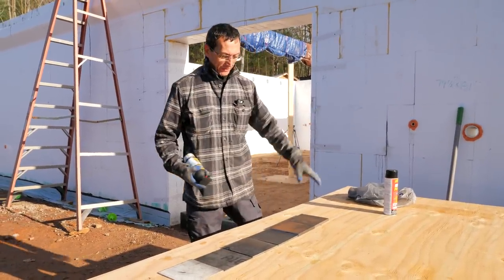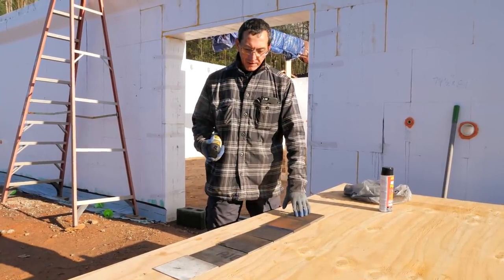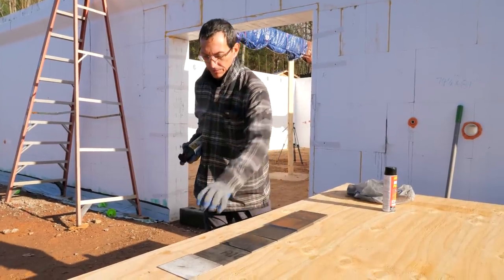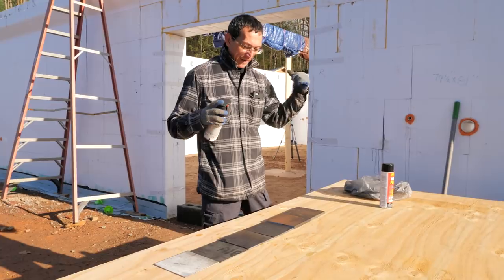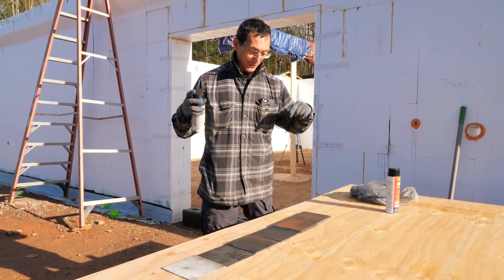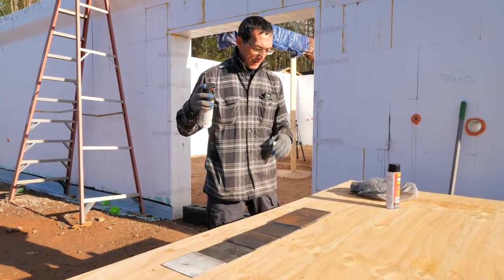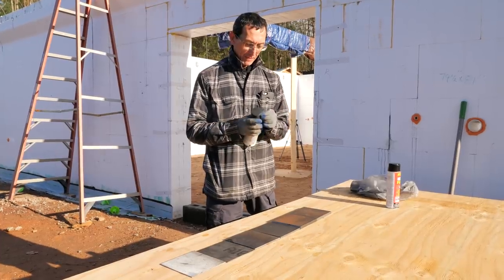When I got the posts, I also got them to cut me some six-by-six plates out of steel as well. So I got a couple half-inch, a couple quarter-inch, a couple eighth-inch — so I can shim the ends of my beam in the pocket and the beam will sit on the steel, not on the concrete. Some people use pressure-treated wood to sit their beam on, but I figured we'd use steel. So we're just going to prime this up real quick.